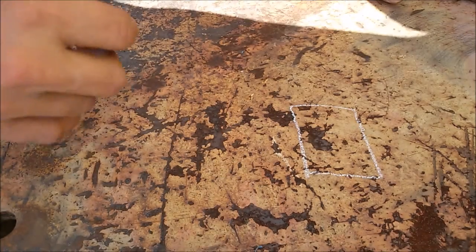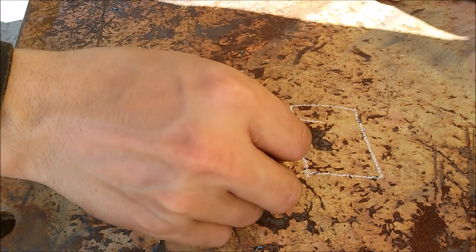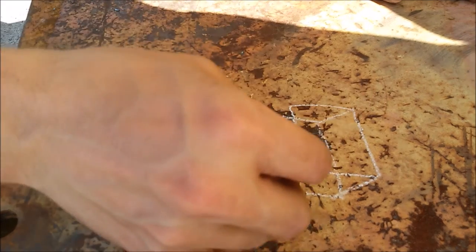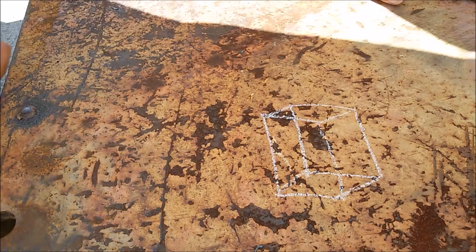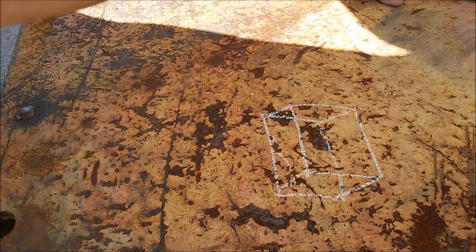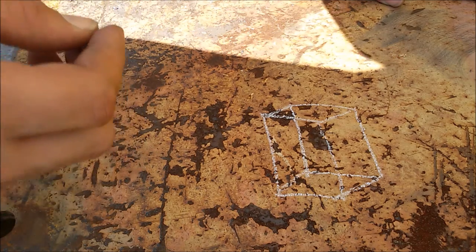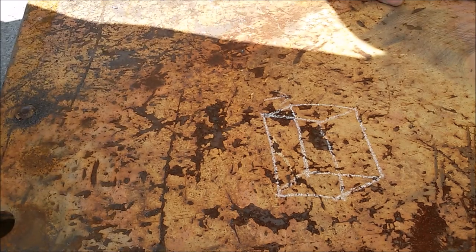So that's something that we're gonna have to take into account. So the box for this, the stand, simple like anything else, could just be two boxes of angle iron up on top, like so, supported by four legs. It's really not that simple. These things aren't that heavy, so there isn't any requirement to put in any sort of extra weight bearing or trusses or gussets or anything like that. However, my main issue, as with anytime I have a top heavy build, is that there really isn't enough room. I have to suspend these things 8 inches up off the ground, 8 inches at a minimum.